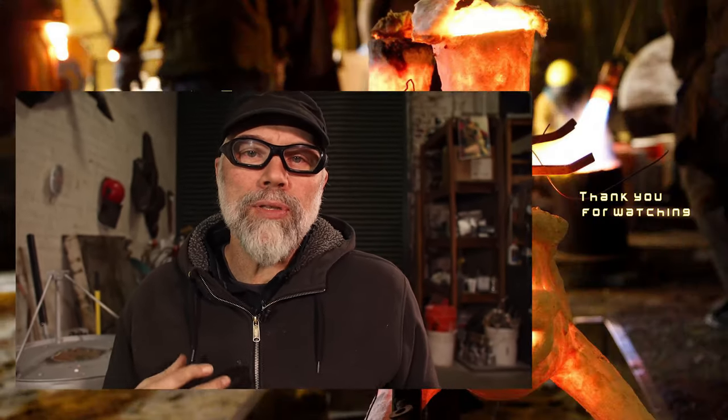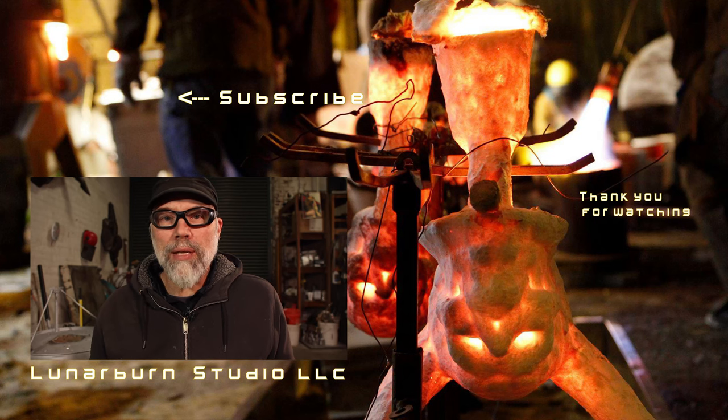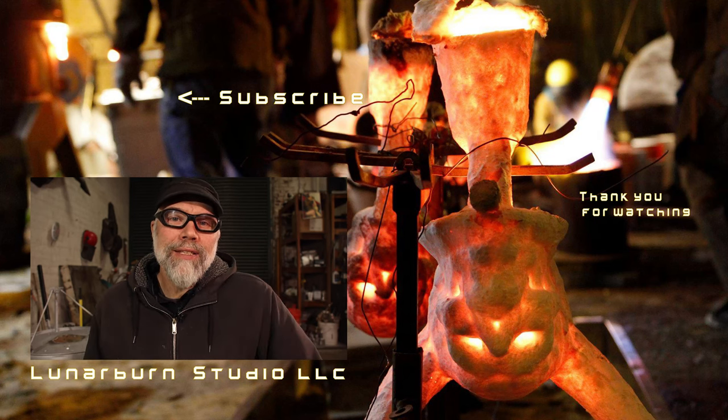After a quick breakout and a quick sandblast, here's one of the skulls that we just poured. It came out pretty well. There are a few anomalies on it, but that'll give us a chance to talk about chasing in one of the next videos, as well as proper techniques for de-investment — breaking off the shell, getting out the core, and things to think about during sandblasting to remove the shell. Until the next video, be creative and be safe.